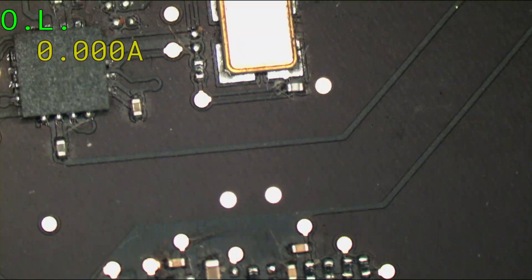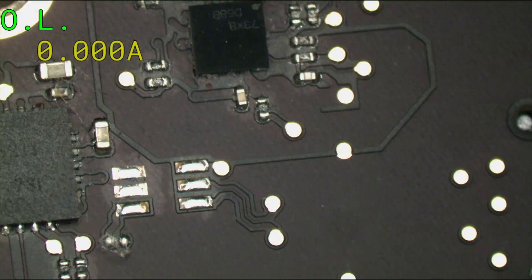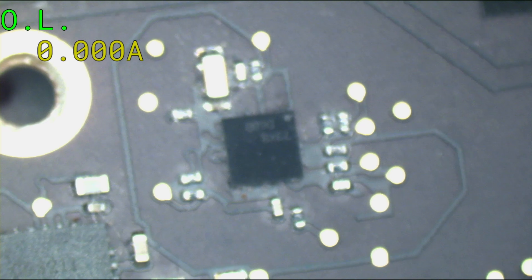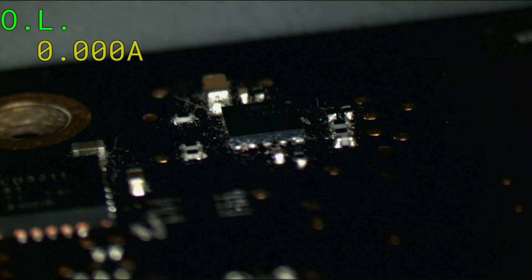See a little bit of corrosion right there — we could hit that with a Q-tip. After looking at boards for years, you get used to what components are supposed to look like versus corrosion. There's some corrosion underneath the backlight driver. New screen, still no backlight — so either the customer or another shop had a computer with no backlight and they just put a new screen in and were upset that it didn't fix it. I bet that's the story. Seen it more times than one.